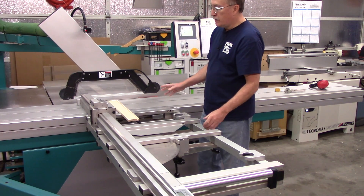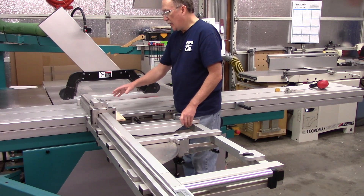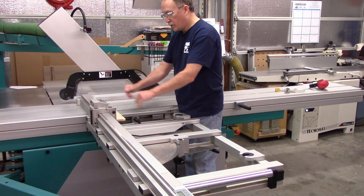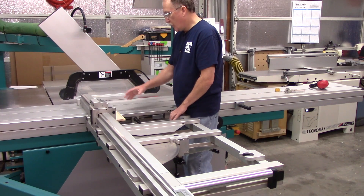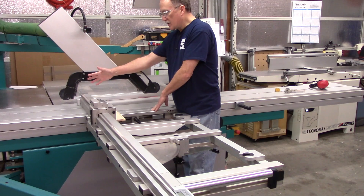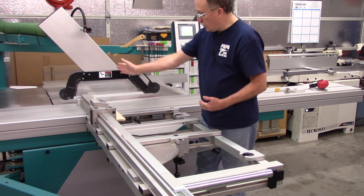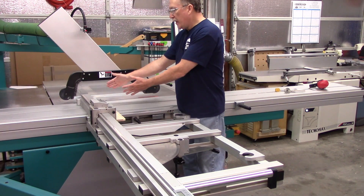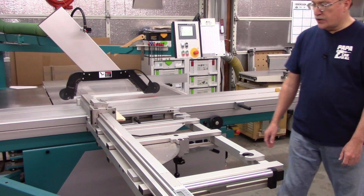The way I normally do my miters, I will make my last cut such that the long points are toward the fence. The reason I do that is because, as you noticed from this length compensation, when I'm doing the reverse angle with the angle mitered back that way, I can get a much shorter piece than I can with the fence angled the other way. So I'm going to show you how I do that.